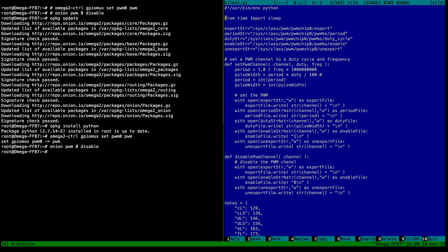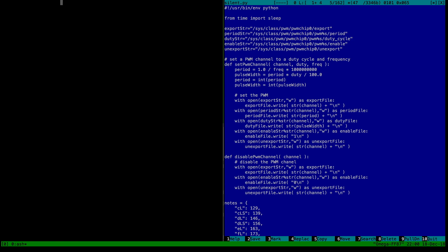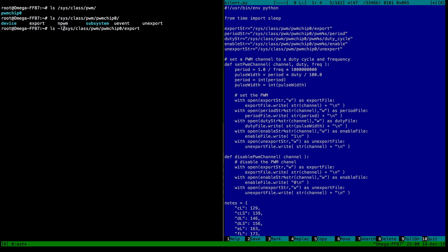The code is basically vanilla Python. The only thing we need to import is the sleep function. The whole pulse width chip interface is exported via files in the filesystem. You can do an ls on the pwmchip class and you'll see there's one PWM chip on here. The most important files are export and unexport — they are writable, and when you write a one to either of them it will create or hide the device files for control of that function.